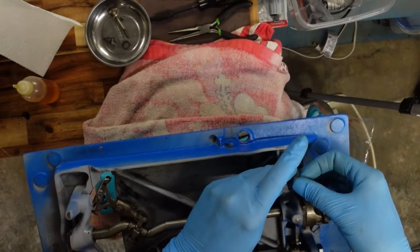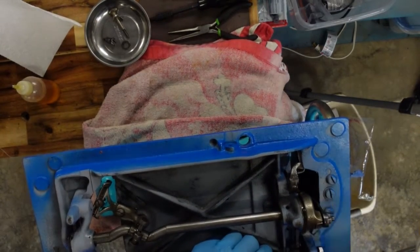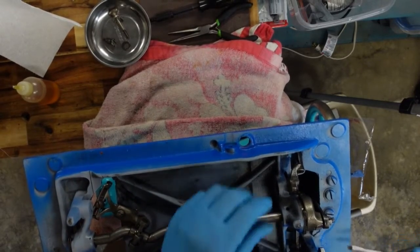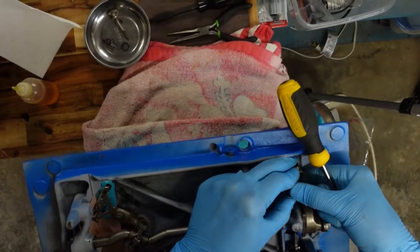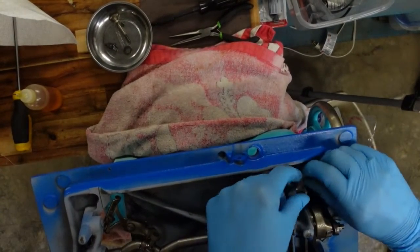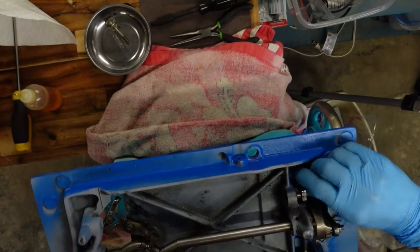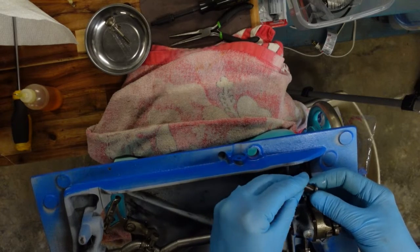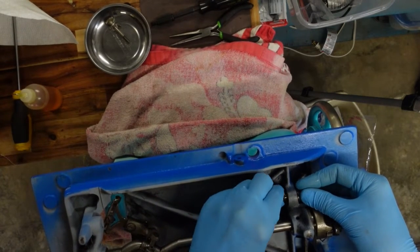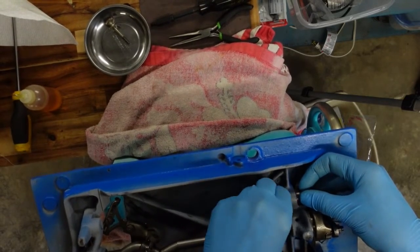I think I am. This block needs to get over here. I can see I need to back this little pivot screw out some so that I have enough room to move that around. So tight — give me one second to wiggle it in. Got it in there, thankfully. From this side I've got a big bearing screw and a wavy washer that goes over that. That needs to slide through here and into the little screw hole at the backside of this block. Once I can feel that that's getting started, I will breathe easier. So that is connected now, moving freely.